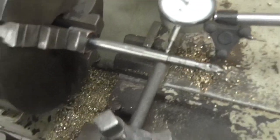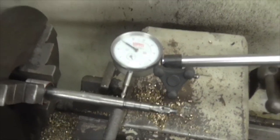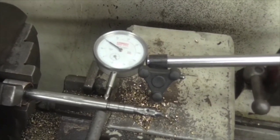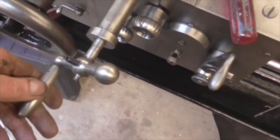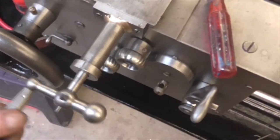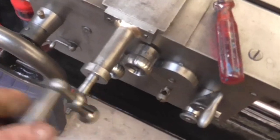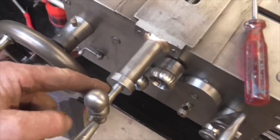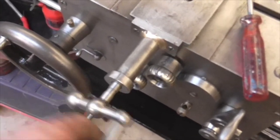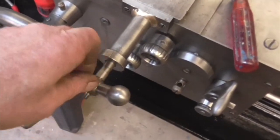Right, we're back in the chuck again. I've put it in the chuck a lot tighter this time and I think it's working. I'm going to persevere and see if I can get it nearly spot on. There we go folks — look at that, it's straight. Or at least it's within five thou. That's close enough. It's getting tight towards this end, but it's made a huge improvement anyway. I mean it was too tight to turn at all — you can turn that with your fingers now.